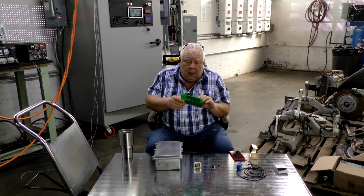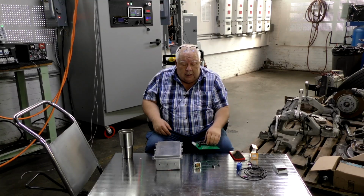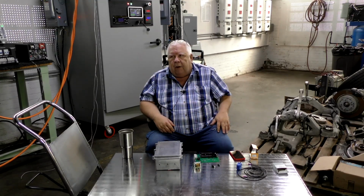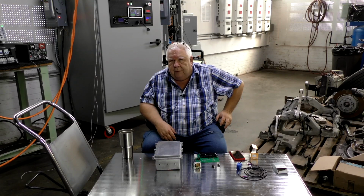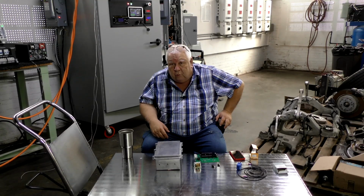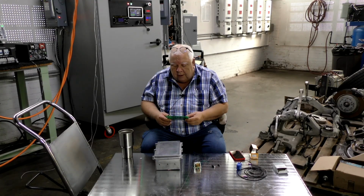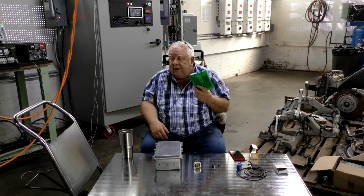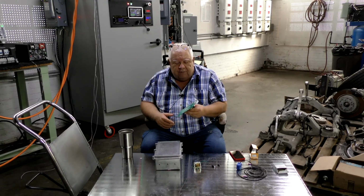We did actually put 6 instead of 4 of the MOSFET switches on here so that you could turn 6 relays if you wanted to manipulate a bank of 6 different solar inputs or something. We built that in for future use, but I'm not sure just what the use would be. But we've got them on there. I run up against the 4 limit quite a bit on the other stuff, and so we put 6 of them on here. So we have 6 switch ground MOSFETs that'll do a couple 3 amps apiece, enough to turn on even a large Gigavac contactor and hold it.